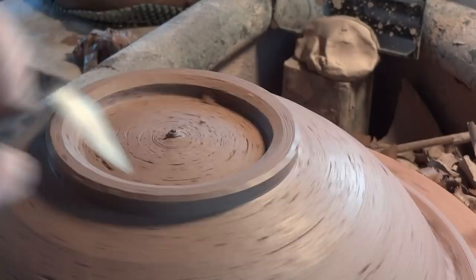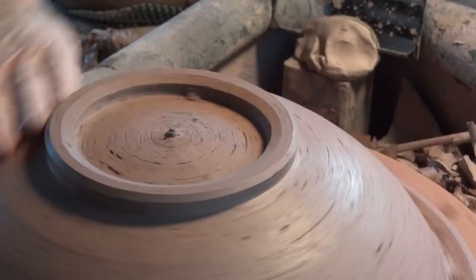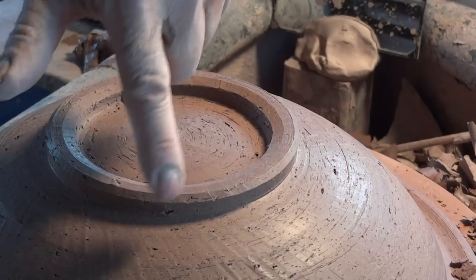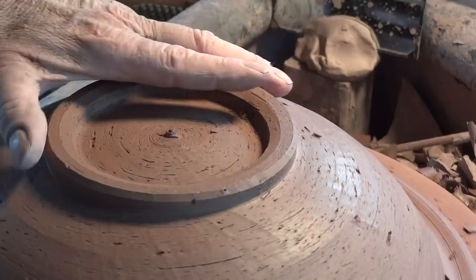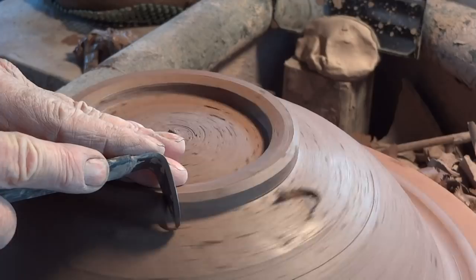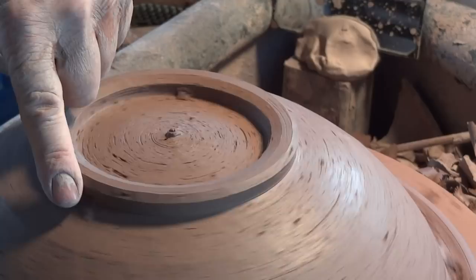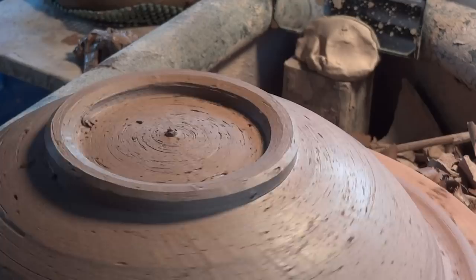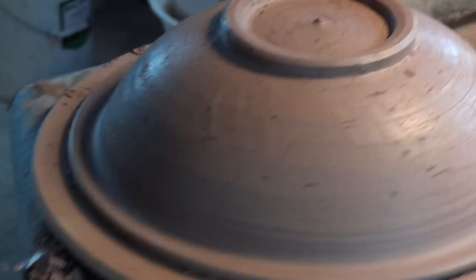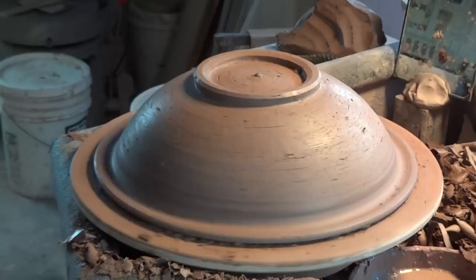You find it does two things: one is it looks better, because you're relating that edge there to this edge here, so you tie them together visually. But the other thing is it has a practical aspect - a sharp corner there is going to be very susceptible to chipping, which we don't want. I think that is it - let's step back the camera a little bit and have a look and see if we like what we've done.